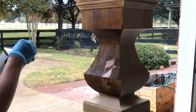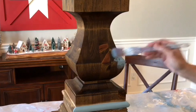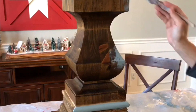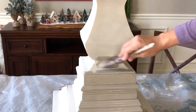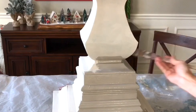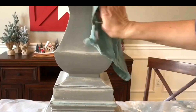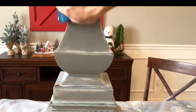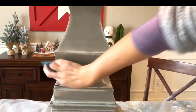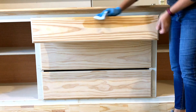What you see me doing here is using the Danish oil as a primer under a layered paint look I was creating. I love using Danish oil as a primer because it's so fast and easy to apply — much faster than any water-based primers — and it creates a great background for layered paint looks. After layering on all those paints on top of that dark walnut Danish oil stain finish, I was able to sand off the edges and reveal that beautiful dark walnut stain underneath.